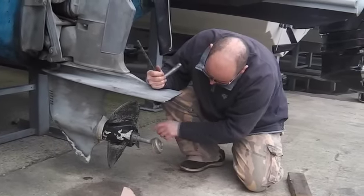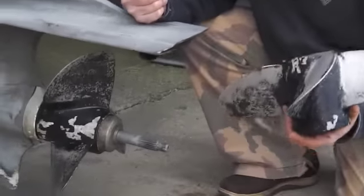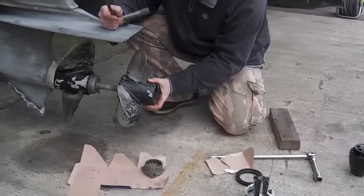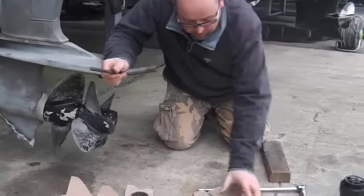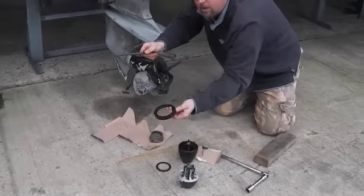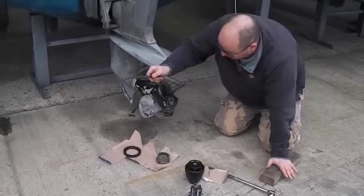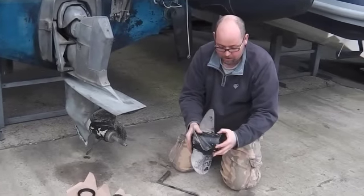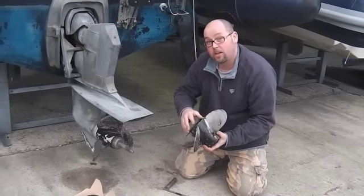Next goes on another shield here to protect the nut. Then this is similar to the one I took off except this one has an intact rubber bearing — it goes on with the metal ring facing outwards. That slides on quite easily. In this particular kit you get two plastic rings. This is designed for lots of different types of propellers — it's larger plastic rings when you're putting quite small propellers on. So the plastic rings go with different sized propellers. The smaller the propeller, it's also smaller in this dimension, and you end up with quite a big gap between them — hence the spacer. These are A8s and I think they only go up to A10s, so these are almost the biggest ones they do and I don't need the spacer. The bigger the props, that gives more speed — but not necessarily more power. Smaller props would be better for towing, giving you a better bite on the water and the engine revs could get a little bit higher. But it's best just to have the right props to match your boat and the type of work it's going to do.